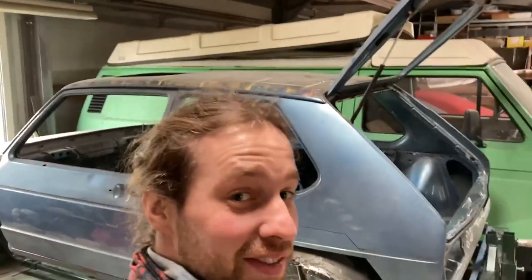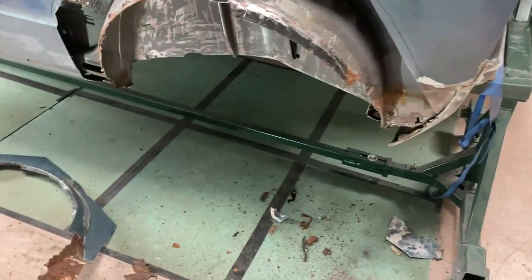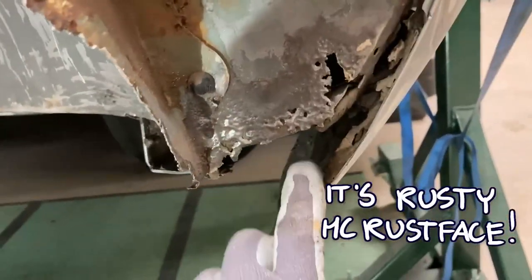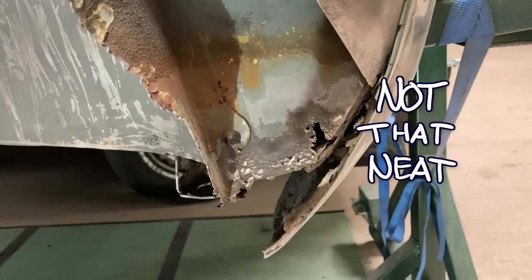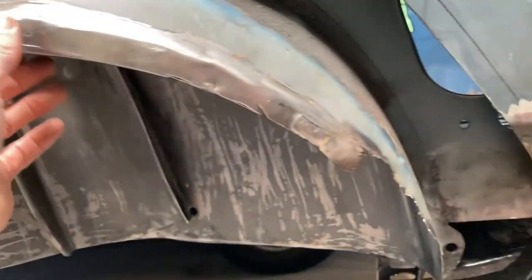Well, there's no turning back now - there's a giant hole in my car, definitely not gonna pass inspection like this. I cut out the side piece and this is the inner fender well. The previous repair job was to not put back this section and instead just silicone it - that's the rust I was expecting. What I did not expect was that this part here was also bad. I'll probably cut something here, weld a piece, and get it covered - it doesn't have to be that neat since it'll be covered up by the panel anyway.